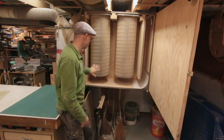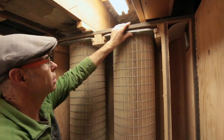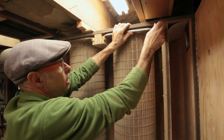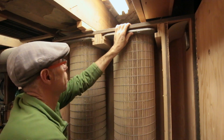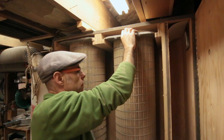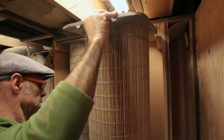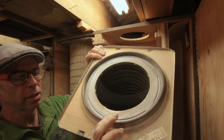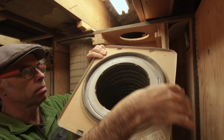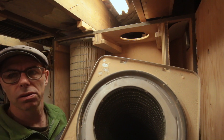So I thought this would be a better way to get better use of all of it. To change these out, I simply squeeze on the top of them a little bit and slide these wedges out right here. The whole filter just slides out of these little slots. You can see the top of the filter has this foam gasket, and that just presses against the top of the box, and the wedges hold it in place.